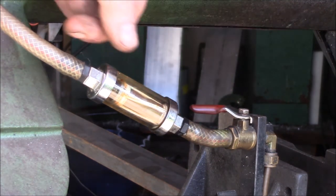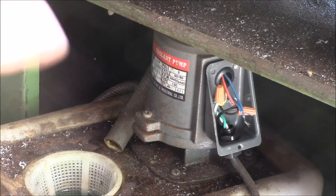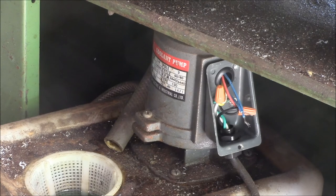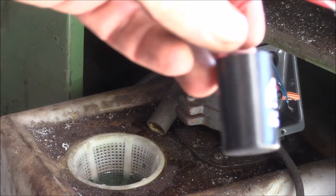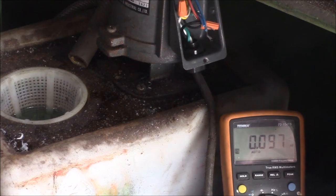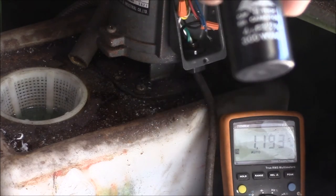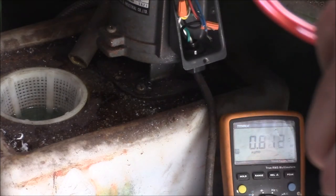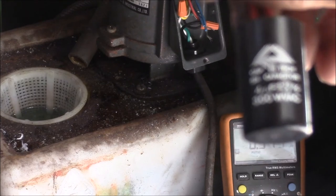It was a little bit plugged but I can blow air through it now — still no coolant flow. I was also a little low on coolant so I added some, and you can see it's now up to the level of the strainer basket. What I found was the motor start capacitor, which is behind that little box there — I've got my meter down in the bottom corner connected to it — it's reading 1.6 microfarads. It's supposed to be 4 microfarads. That's about 40% of its rated value, so I imagine that starting capacitor is kind of weak. It doesn't look bulged or anything, it looks okay, but it's just on the weak side. So I went and ordered a couple off Amazon — they'll be here in two days.